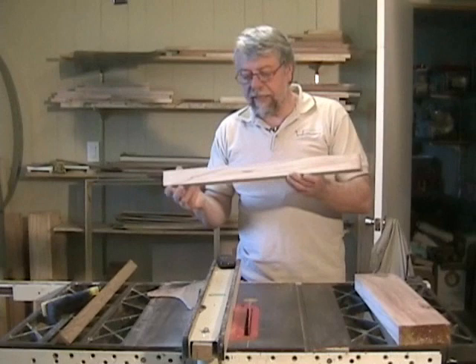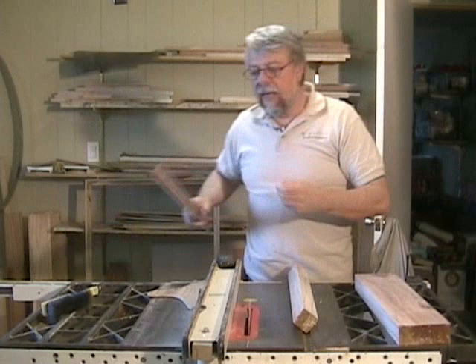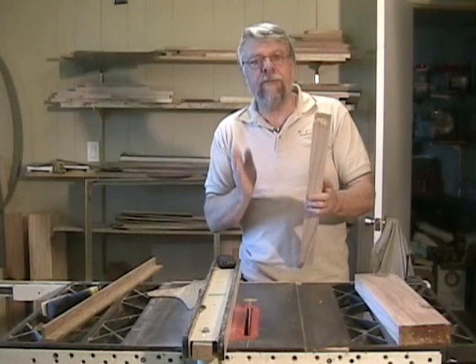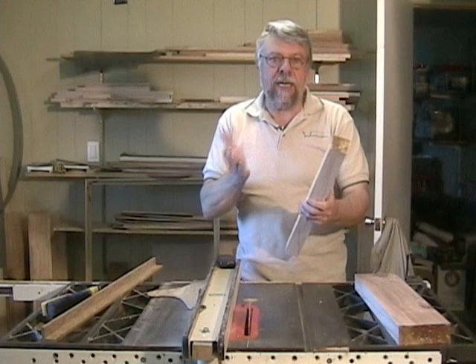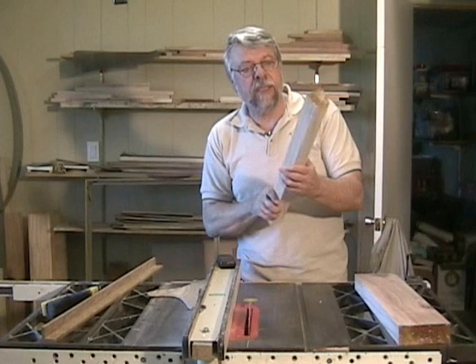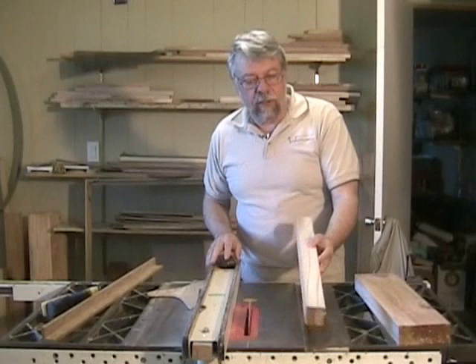We've just made this material absolutely square, and the next thing we're going to do is cut the inside to make it concave like this. Now, this is for demonstration — what I've found is that if you're making picture frames, it's best to actually cut the 45-degree angles before you start trimming the material. But because we're just making the material today, we're just going to show you what it's like to make that material. The next thing you need to do is set your fence and your table blade height for the correct width.